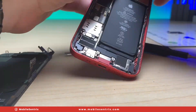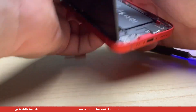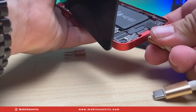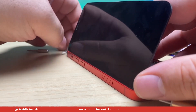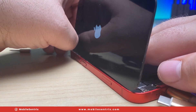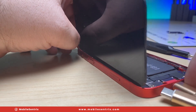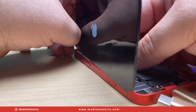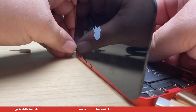So now I'm just going to disassemble the phone and disconnect almost every single connector. I'm going to reconnect the charge port so that we can prompt it to boot, but everything else is now disconnected — power button, all the cameras and everything. So if it's one of those components, we won't get a boot loop — and there's the Apple logo. Checking the board for a short with my hand and I feel it's getting pretty warm, so there's probably a board issue here. It's still looping — yeah, there's definitely an issue and I'm going to conclude that it's a board issue. Let's go ahead and take it out.